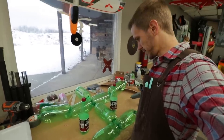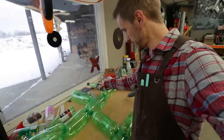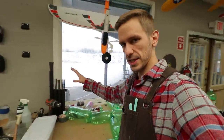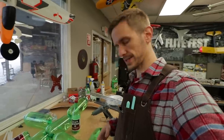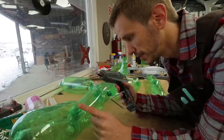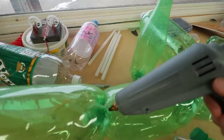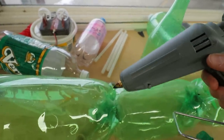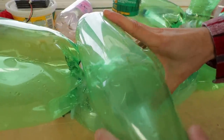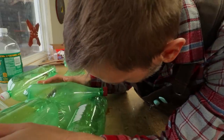It's taking shape. I think I'm actually going to go with two motors — these bottles will help give this joint some stability. With two motors I can have what's called differential thrust: one motor can go faster than the other to help the plane steer, and then I won't need a rudder, so I can do less control surfaces and fewer servos. I've discovered that on the thinner part of the pop bottle, the hot glue really melts and starts to crinkle it, de-shaping it. I've developed a new technique at the butt — it's much thicker plastic and doesn't deform. I put the glue on the thick part of the plastic first, let it cool maybe 30 seconds, and then work it in.